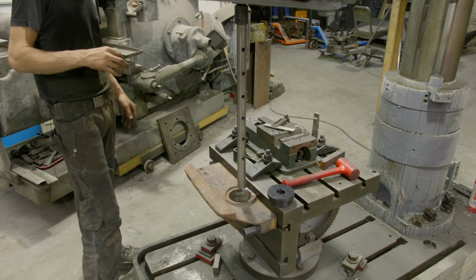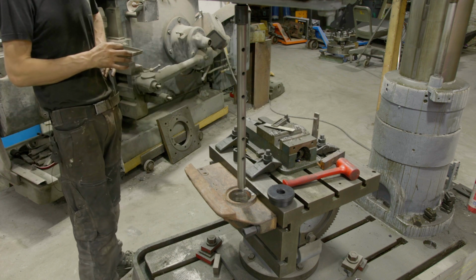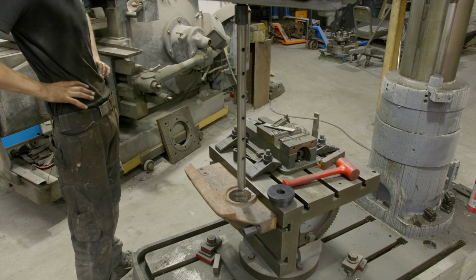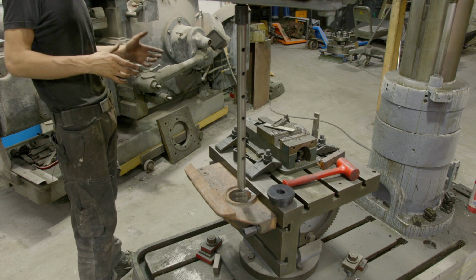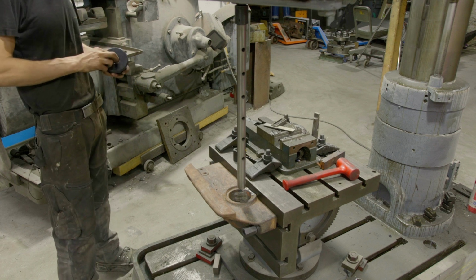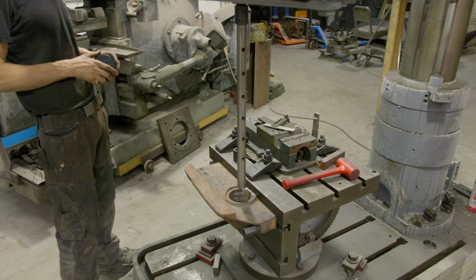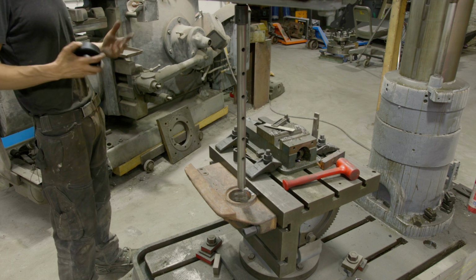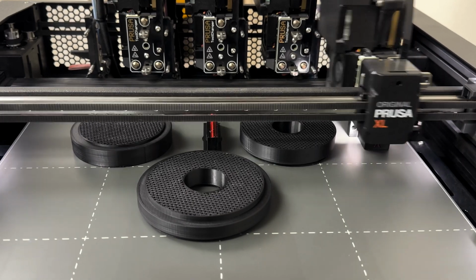So as far as tooling setup, we have a 1 1/4 bar. You've seen me make a 1 1/2 inch bar in another video. That one has square holes. This one has round holes. And then as far as centering the bar on the bore and getting it lined up, I'm trying something new, and we'll talk about this more in the future, but I acquired a 3D printer, and I thought it would be a perfect opportunity to make functional parts that don't need to be metal for different applications in the shop, and this is perfect. So I printed up this centering cone.